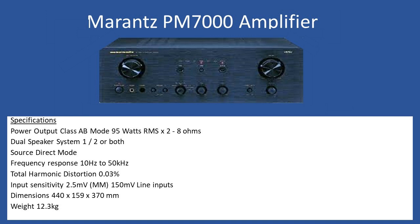The issue with this amplifier when it came in is not uncommon — the customer reported intermittent loss of audio, which repair engineers see on a regular basis. Looking at the amplifier circuit design, the issue is due to the speaker protection relays. The relays are sealed; you could try opening them but it's difficult, and commonly the contacts are heavily oxidized and sometimes pitted.